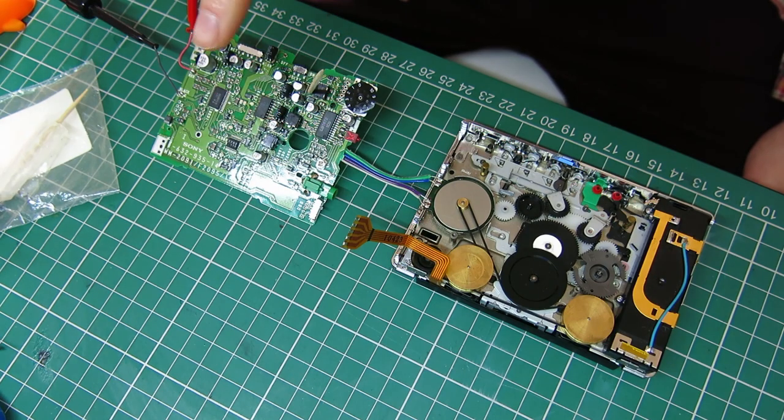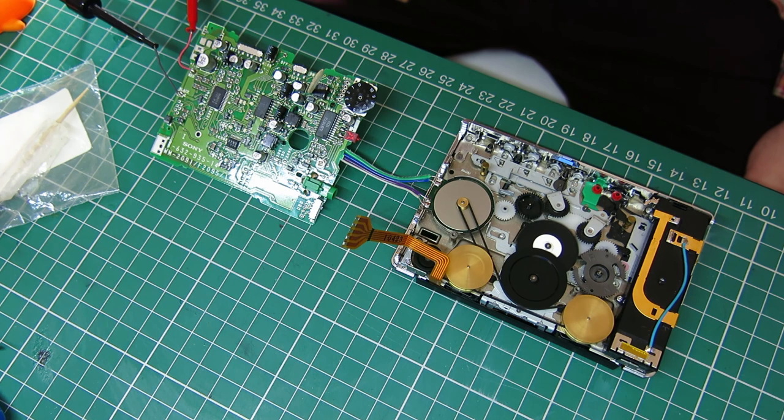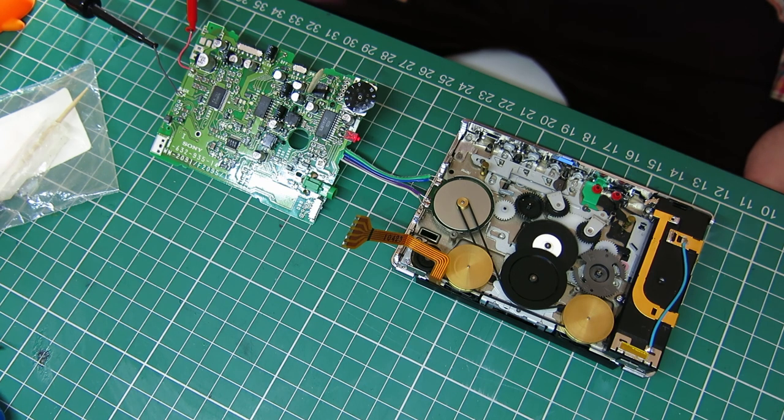I've soldered the proper board, the one that we've just rebuilt, to this temporary wire to the chassis that we've been working on. The power supply is at 1 volt. And it can start up from 1 volt. That's pretty impressive. Let's go to 1.1. Yeah, a bit quicker. 1.2, which is the standard voltage of the gum stick battery. Yeah, pretty happy there. And 1.5 should be the nominal voltage of an AA battery. Even quicker.